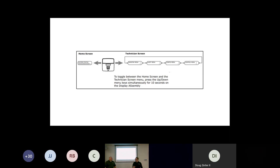And then it also asks you for your kW, and you need to tell it how many kW, because then it's looking for, not every W1, 2, or 3 gets hooked up, depending on how many contactors. If you only have a 10 kW heater, we only have 2 banks of heat. So if we have W3 hooked up, we're going to get an alert saying it's calling for more heat than what it's configured for. Correct. Yep. And so there's just a whole bunch of information there.